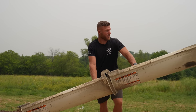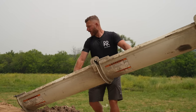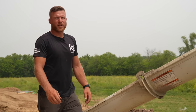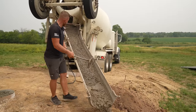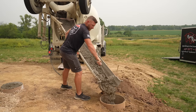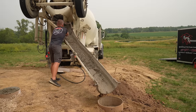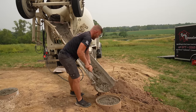No problem getting concrete out today — called them and they said they'd be right out. You never know in the summer, it's hit or miss, but looks like we got them out here pretty quick. We'll get these poured. Should be pretty easy. This is one of my favorite drivers. We've got about a third of a yard, maybe a little bit more, going in these holes. Nice thing is I can kind of control when that sucker gets turned off so I can get him empty to move to the next hole without a ton of creep in the back of his chute.